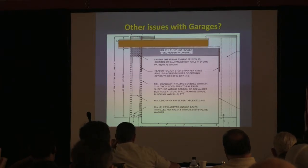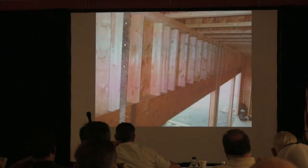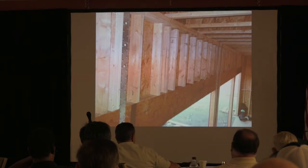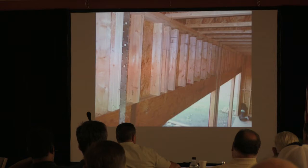One of the things that we also want to talk about is we've got our header right there. But what's missing? There's no plate across here, is there? And you're going to probably see this about 70% of the time. They will do this and say, what is the deal? Why do I need a plate? Now, we've got a double LVL here, right? And we've got studs right in there. Any understanding why this is supposed to have a plate there?